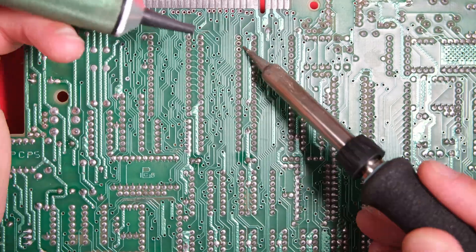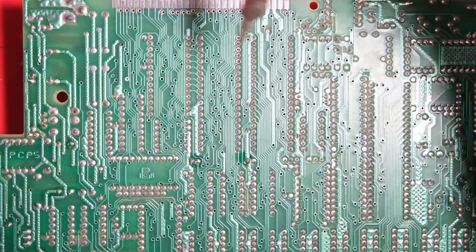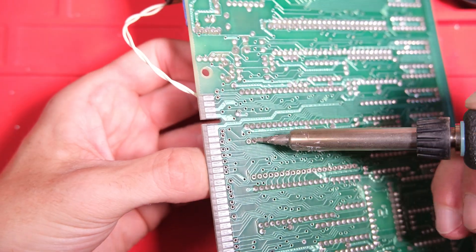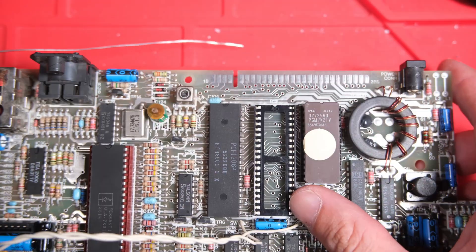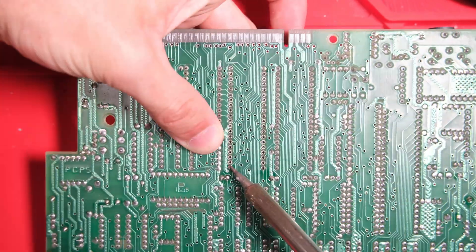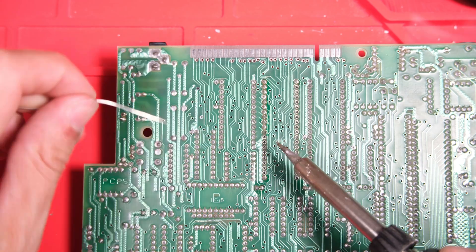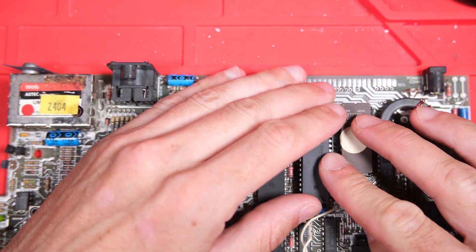Maybe a chip with a very strange finicky cold start problem. I'm going to start by replacing the Z80 - which now I'm editing the video I realise isn't a great idea, because the Z80 seemed to be working perfectly once the machine was up and running, so chances were this wasn't it. In goes our new CPU - and yeah, that certainly hasn't fixed the issue.